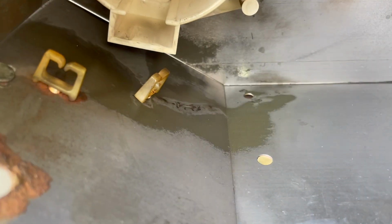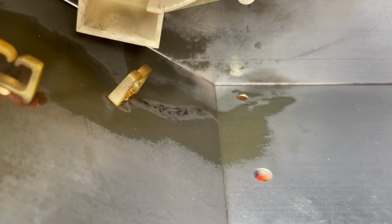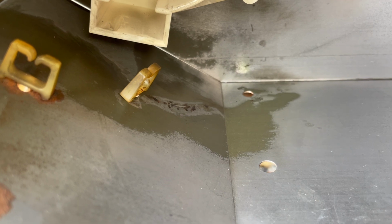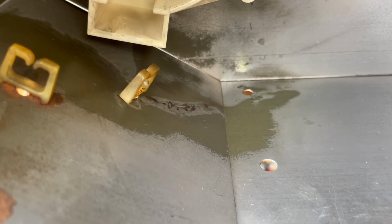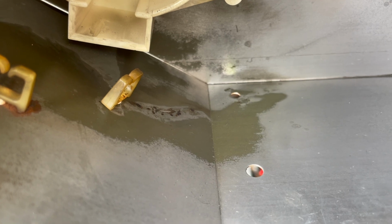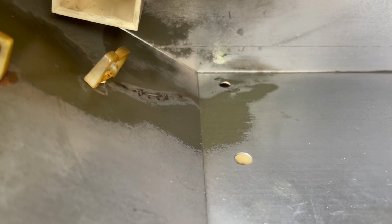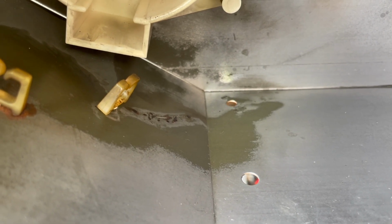It was definitely arcing, for sure. And that would have definitely killed the high voltage in this system, because once the rectifier is conducting, there's actually 25,000 volts on those 2 filament leads as well, because the cathode is common to the filament. So this high voltage arcing is really a problem. I figured that at the time, but we needed to go through this process.